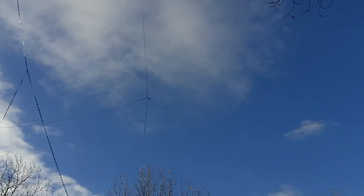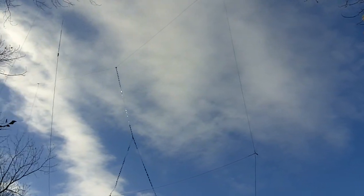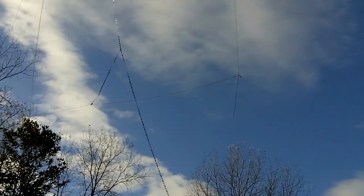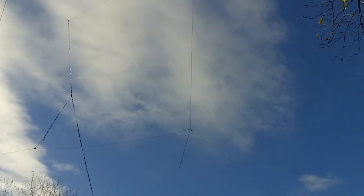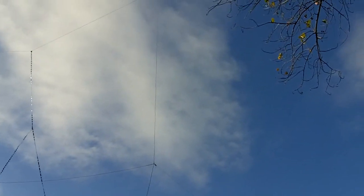This is an updated video of some of the antennas I'm currently using. This is a Lazy-H wire antenna, basically centered on the CB band. It uses four half-wave elements fed in phase and it's fed with a 450 ohm ladder line right there in the center. I'm using half-wave spacing between the two bottom elements and the two top elements.